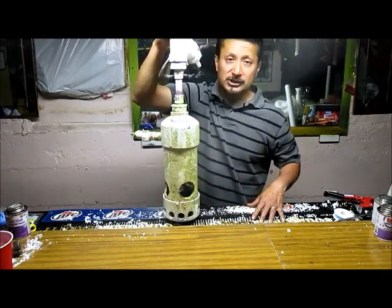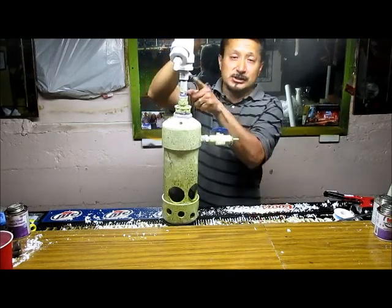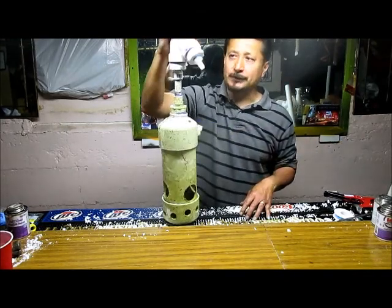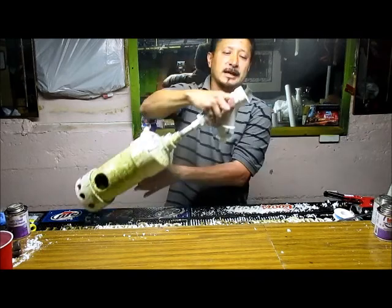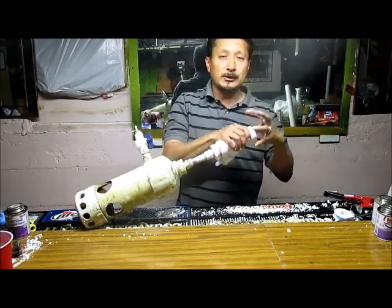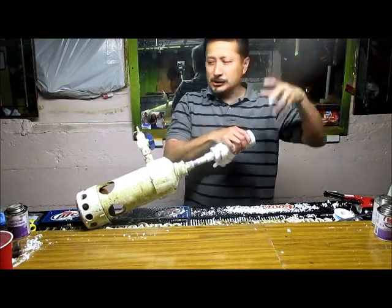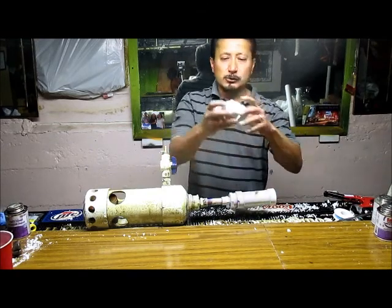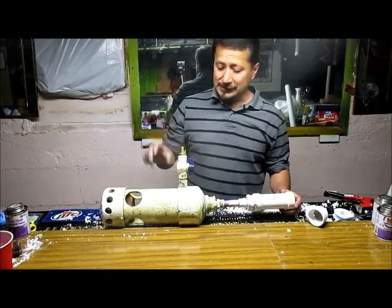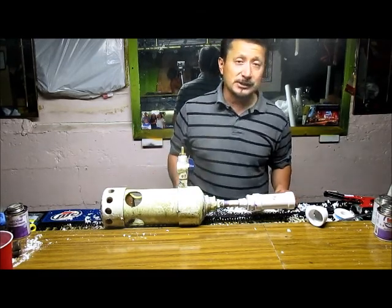The water flow will fill the inch and a half pipe with water — it'll probably be a slow trickle into my tote at first — but with the water pump adding volume, there'll be more water exchange to clean the pond. It was crystal clear with just the half inch pipe, but I'm adding fish this week so I wanted good circulation before then. It's all glued together now; I'm just not gluing the final piping until tomorrow when I get my measurements and run it straight up out of the pond to the angles going into the tote. Watch my other video to see how I made this, and we'll see how the whole thing works tomorrow. Thanks for watching!